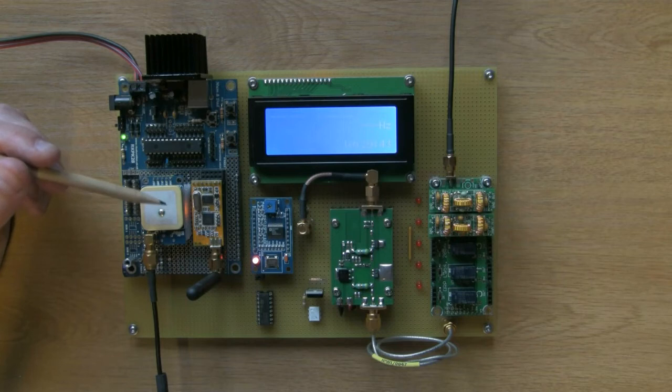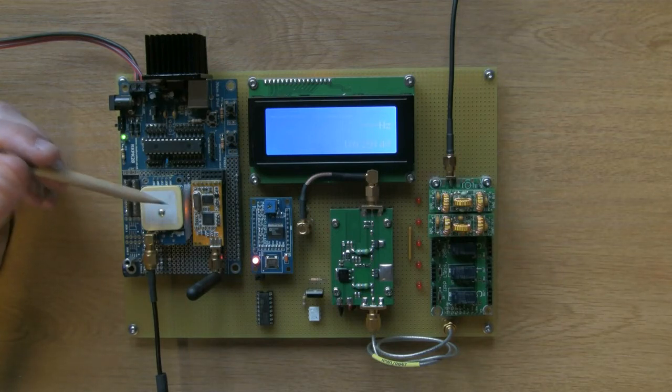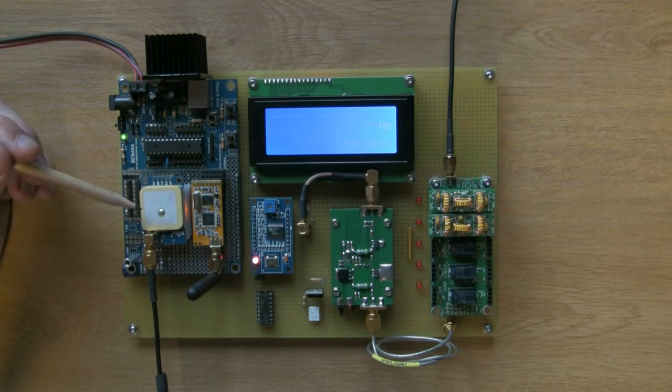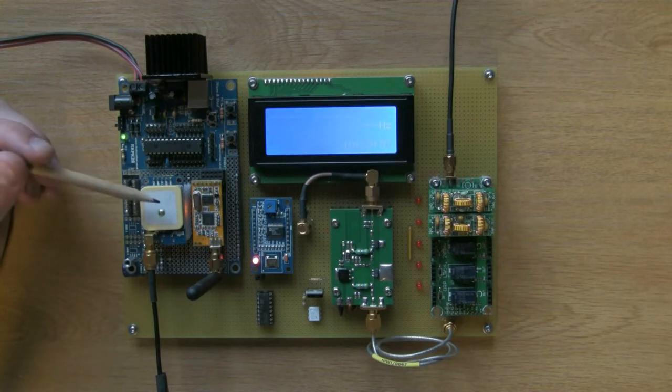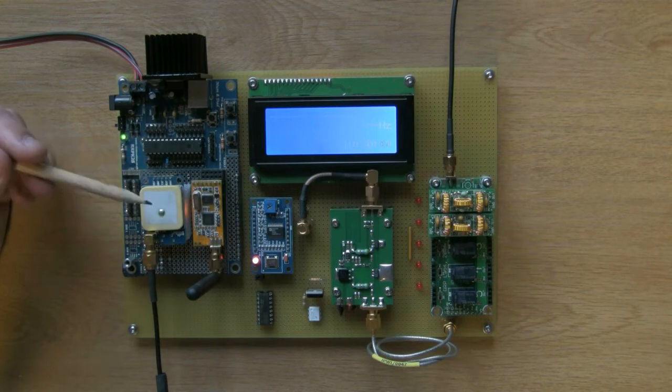There's a little LED on the board. The main guts of the board are on the underside with the LED. This on the top of the GPS is its passive antenna, which sort of came with the module, so you can either use that or the external antenna, whichever you like. My workshop's got a metal roof, which is why I'm using the external GPS, because my Whisper beacon design won't transmit unless it's got GPS lock.